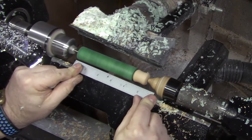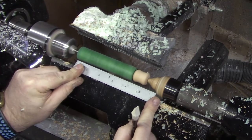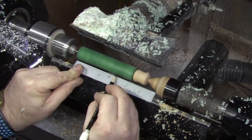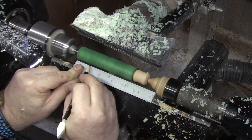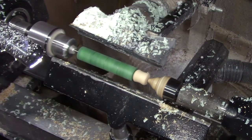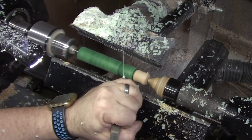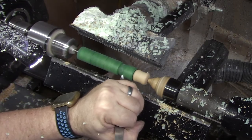Okay, it is still spinning, right? It is still spinning. And that's on purpose, because I have it chiseled out to the right so that I can place the ruler closer. And then because it's spinning, all I do is hold the pencil against the blank and I get my lines. I just spaced them out approximately, I guess it was a little more than an inch apart, because the blanks are 5 1/4 and there's basically 5 sections to this.